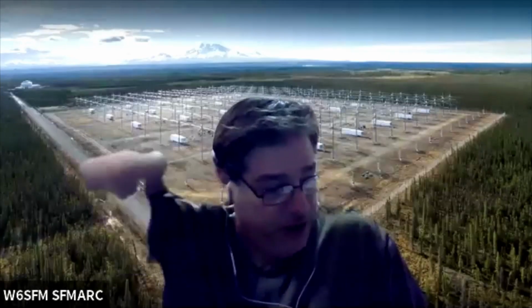Right. It snapped that insulator, I think. Oh no, you know what it was? It wasn't the insulator that snapped. It was the 3-foot pole that has the insulator in it. I had about a foot sticking out of the ground, so the insulator was about 1.5 feet above ground. I lost mine like that too. Yeah, and it snapped that metal off, so I had to buy a new ground pole with the insulator in it. And it turns out that the new ground pole they sell, the insulator, although the right size to fit through the other tubing, the hole that lines up was not the same distance for the base loading coil, the inductor.